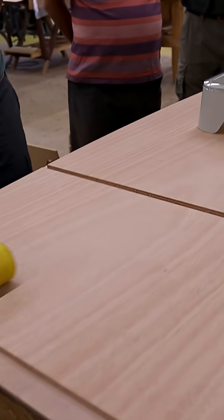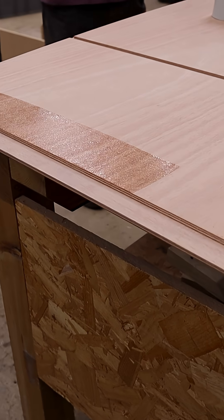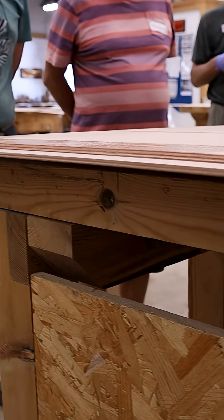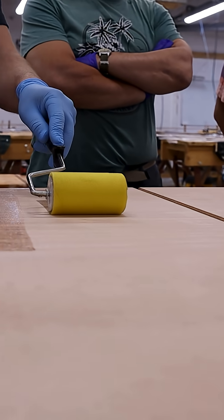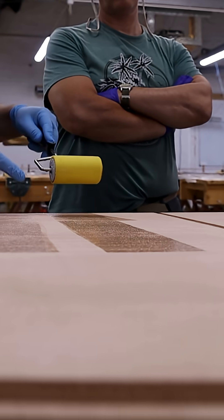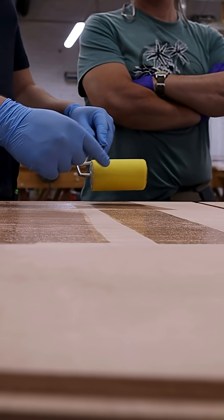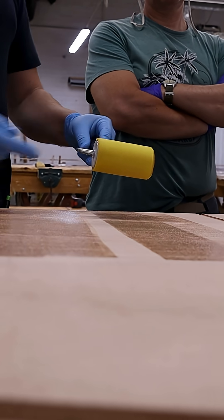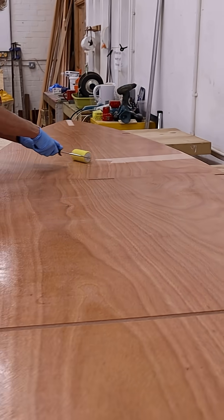Then we'll come in and roll across the grain. With this we don't want to be coating any of these recesses — you can see we can just go very neatly over that edge. From the previous bit, I roll that on and in that first roll I'm going to gauge how much I've got on it. If I've got way too much resin on my roller I'm going to spread it out a bit more. If I haven't got very much I'm going to come this way.